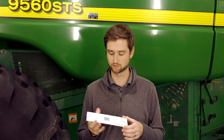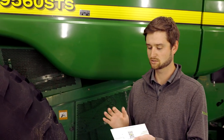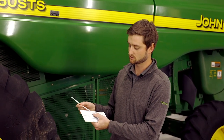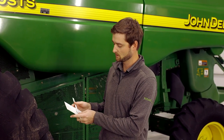To do this you're going to need your tread depth gauge that measures in 32nds of an inch. If you have one of these new white gauges — which is what we're shipping out with 2.0 — follow the instructions on the front to set it up properly. Slide the ruler portion through the two slots of the gauge, and you'll be able to get your measurement in 32nds of an inch.